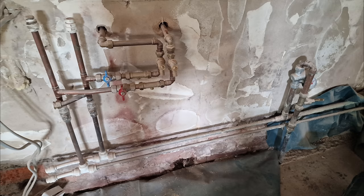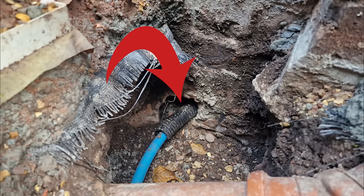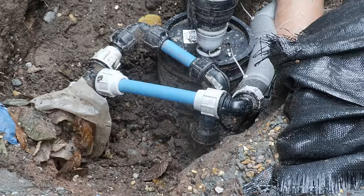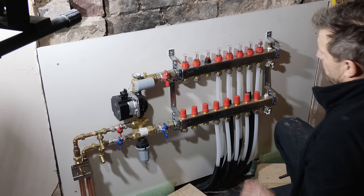There's so much to think about when retrofitting underfloor heating, and the first was moving the water main as we're moving the kitchen to the other side of the room. It was a relatively simple job once I'd broken through an old soil stack in the room where I wanted the new main to come into — basically disconnecting it from where it entered the kitchen and rerouting it into the room next door.